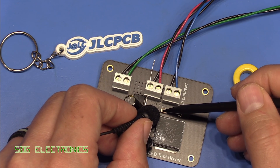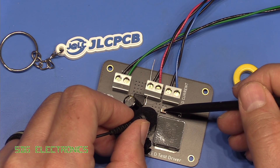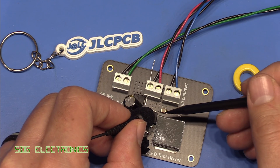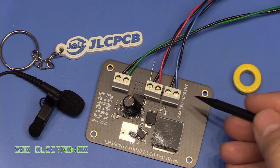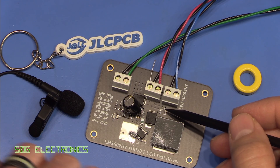With the microphone again, we're getting quite a change of tone over here on C4. C4 is there to reduce the current ripple in the LED, but for testing we can probably try removing that and see if it has any effect. Capacitor C4 is now gone. Let's turn it on — and that appears to have made a huge difference. I now cannot hear any tone from that PCB whatsoever. Let's try adjusting the frequency. It's pretty much silent. So it looks like that output capacitor was actually the problem.